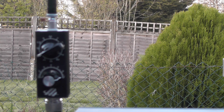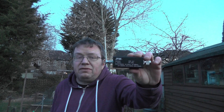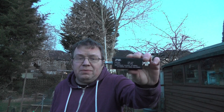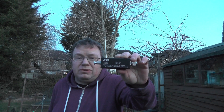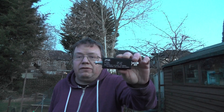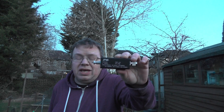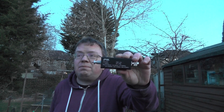But for just receiving so far, it seems to be okay. So there we go — the ZFGL antenna for HF, UHF and VHF. We tested it on 20 metres and were able to receive some stations. The SWR was a bit too high, but hopefully the counterpoise wire will bring it down so we can finally make some contacts. The idea is I can take this antenna to work with my ICOM 705, place it on top of the radio, throw the counterpoise wire out, and hopefully make some contacts across the band — play some radio on my lunch break.